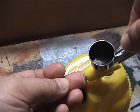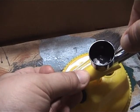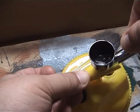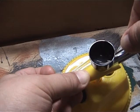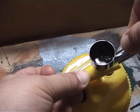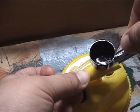And what that does, it churns the paint and the thinners together and really mixes it nicely, as you can see. You only need to pull back a little bit on the stick, not too much. And that's aerating the thinners and the paint together so you get a nice consistency. What you want ideally with your paint mix is a bit like milk in consistency. That's the kind of thinness you want to go for.